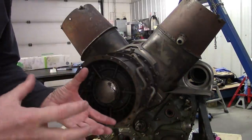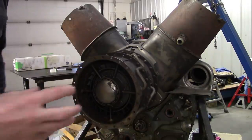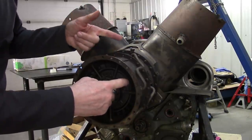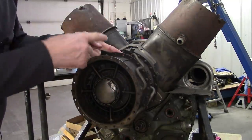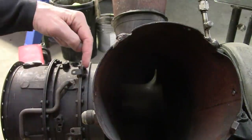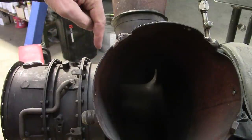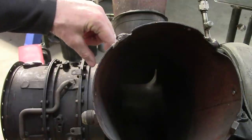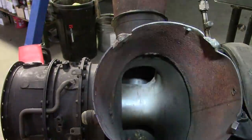The air comes out here — the combustor's been removed. The combustor accelerates the air into the first stage nozzle. The first stage turbine is behind there, second stage turbine's behind that. The air passes through a nozzle here that goes into the first and second stages of the power turbine — it's a free power turbine — and the exhaust of those comes out here.